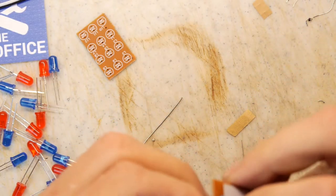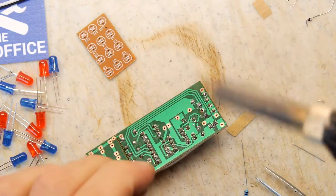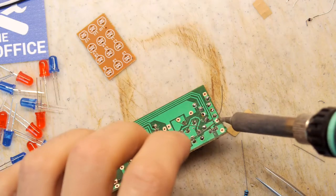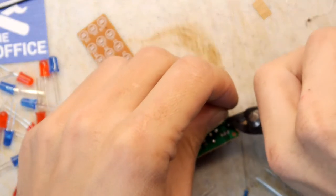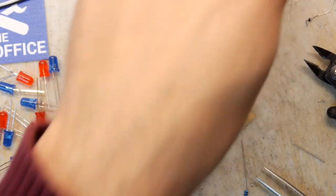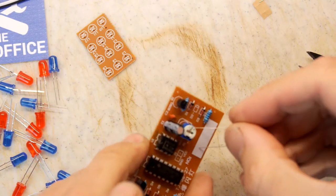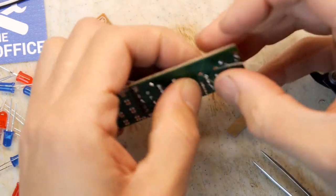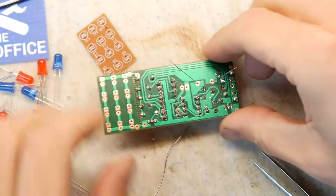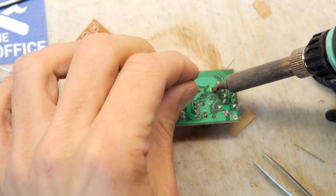We do have an opportunity with that diode, actually, because with that missing diode we could run it, and when we run it, we should see a weird timing going on. And then we can short across where that diode was and pretend they didn't use a diode, see what happens, and see if that causes that decade counter to totally freak. Last 10k. There's also the danger, of course, it might blow the decade counter to bits, and that might be an undesirable operation.